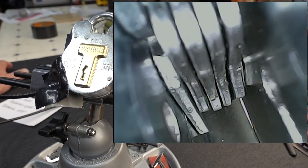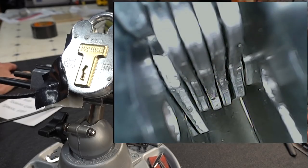I've got the camera up inside the hole we drilled, taped in place — it shouldn't jiggle around too much. Just to explain what you're looking at: these are the four levers right there in the top center of the screen. Those are the four levers we're going to be picking. On the far left you can see what looks like a wafer, but that's actually the tensioning bar.